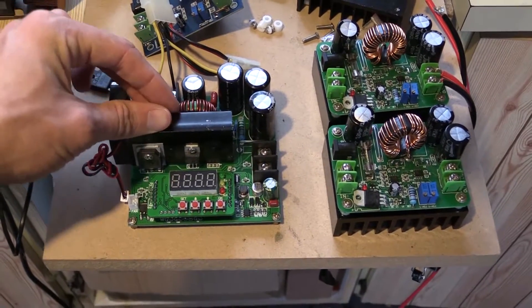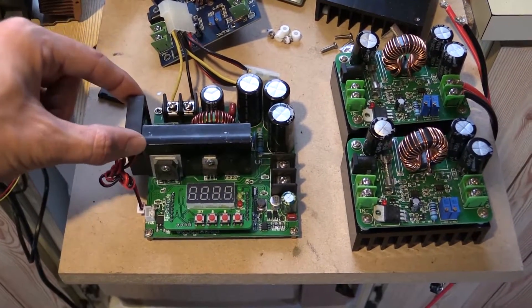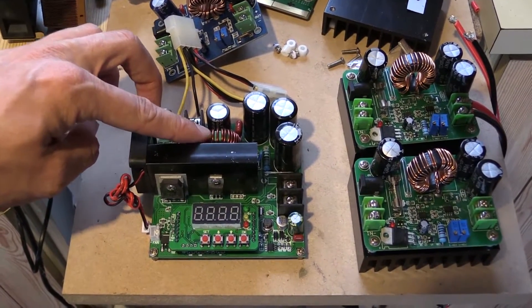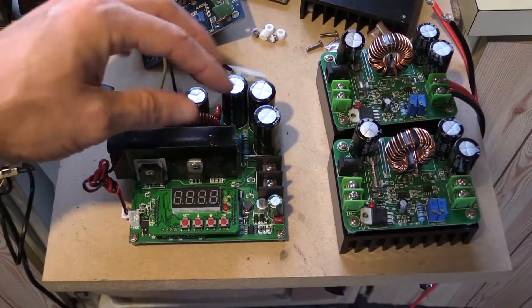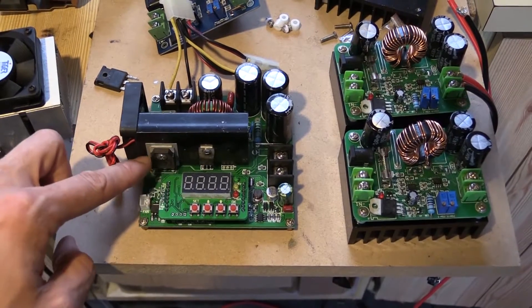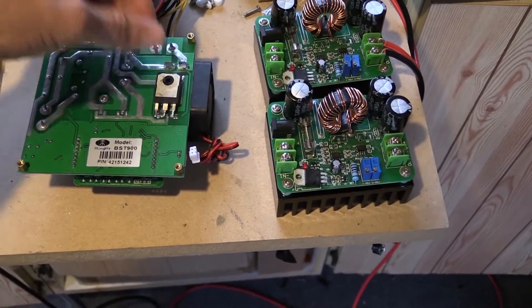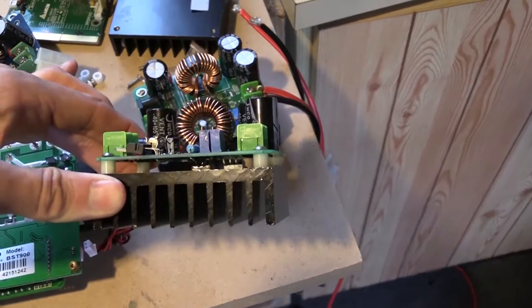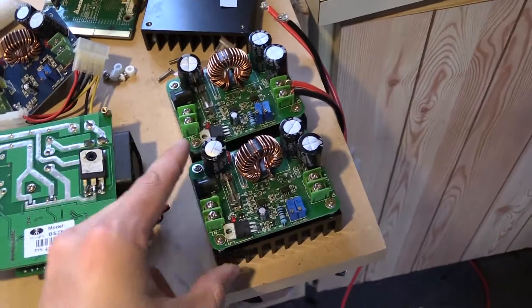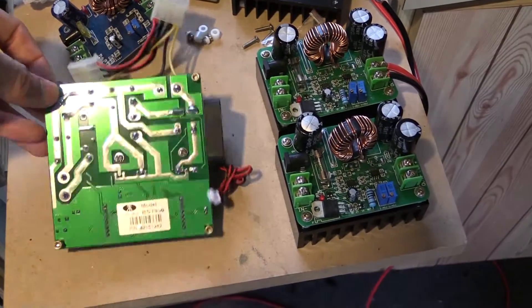What I'm going to do is unscrew this heat sink and only connect up the power diode here to the heat sink. I'll have the fan connected so that it cools the inductor, because the inductor gets hot when you're drawing a few amps, definitely for a long period of time. I'll put the heat sink back in place again so that it's cooling the top area of the board, the inductor and this heat sink. I'll move the power MOSFET to underneath the board on this position, so it'll sit something like this, and then I can bolt a heat sink here — very much like the exact design that this unit here has, where the two power MOSFETs are bolted to the bottom of the board and to the heat sink. That's a much better solution, and it means I can have a big heat sink and keep this nice and cool, so hopefully I won't blow it up.